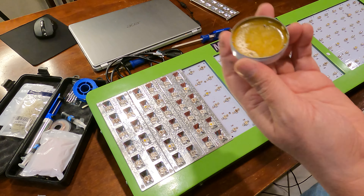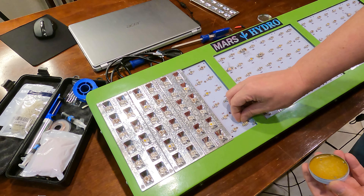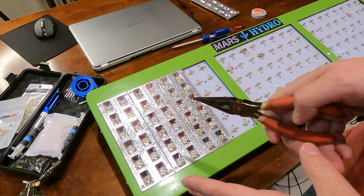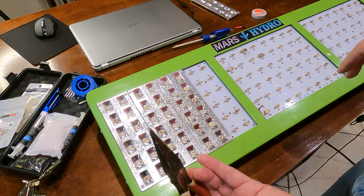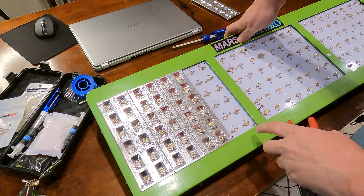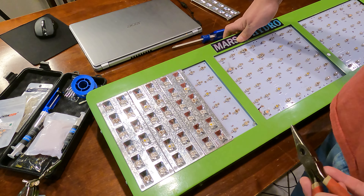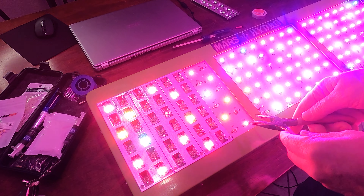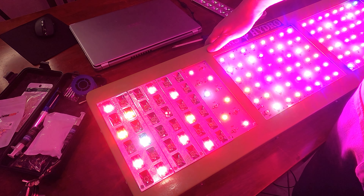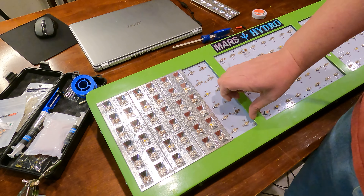So I'll get the soldering iron out. First I'm going to rub a little bit of flux on those two solder joints to make it a little bit easier to get it off. Another trick to find the bad LED - make sure you're on direct current to do this - is you need a pair of needle nose pliers and you short across the LED. We already know that's the bad LED, so I'll show you what happens when you find the bad LED with needle nose pliers. But wow - that one lights up! So clearly the LED I was about to work on is not the bad one.